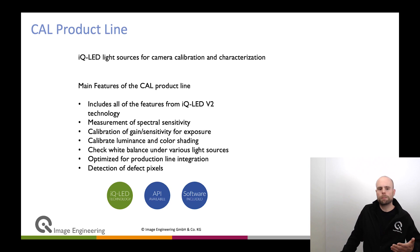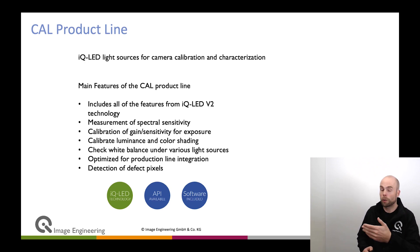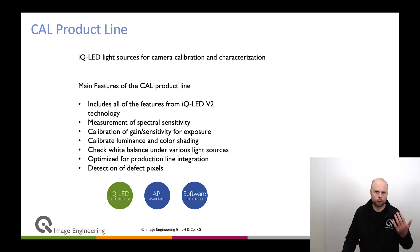You may want to check or calibrate white balance. For that, it's very useful to have different illuminants so that you can create an A, D50, or D65, all reproducible, ensuring that the user has the same experience when they use the device outside as you had on the production line. You need a really good daylight — it should be daylight that you use or mimic with the IQLED. Also, detecting defect pixels might just need a gray image, and you can do that.